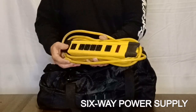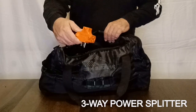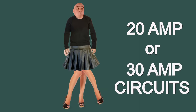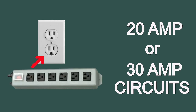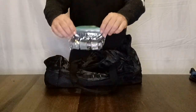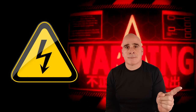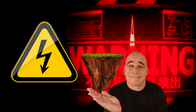There's an extra six-way power supply with a very long extension cord, and also a three-way power splitter. A tip to remember is that most stages are on 20-amp or 30-amp circuits, with at least two legs — bonus if more. Stay under the appropriate value when dividing power from a single source, otherwise you'll be tripping breakers all night. I also have a bag of ground lift adapters, which can eliminate that annoying buzz from ground loop situations on certain stages. I don't recommend lifting the ground on any high-powered piece of equipment, so do so at your own risk.